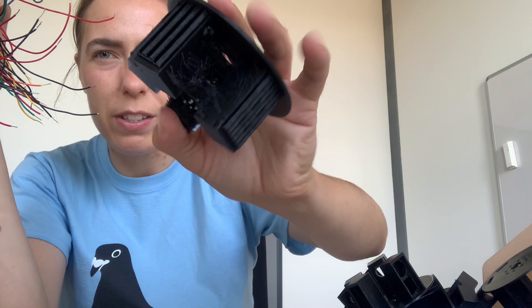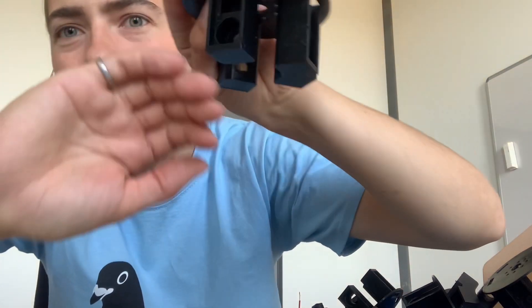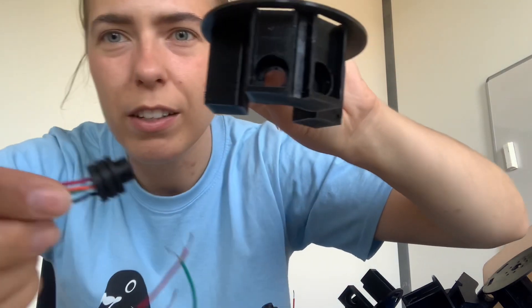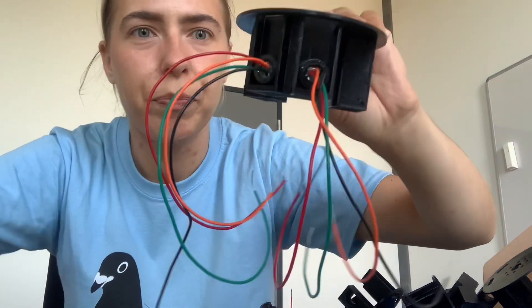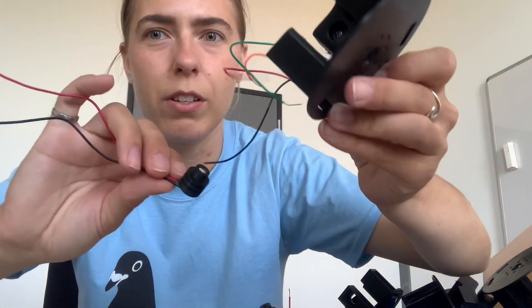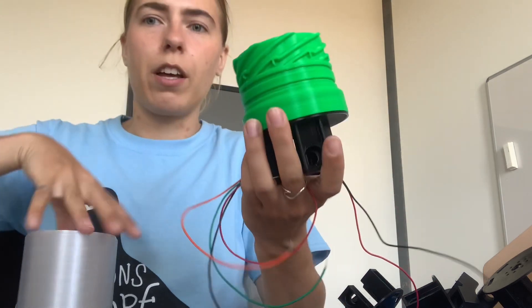Some of them I have to finish cleaning from the 3D printer — you can see it has all of the supports still. The idea is in here I'll have two detectors. One detector goes in, one goes in here, and then the other one goes in here. The wires will come up through here, and then this entire part right here will be filled with epoxy. The LED goes in this last one here. The thread will be glued on top like this so that the wires come up through there. And then the casing goes on top like that.